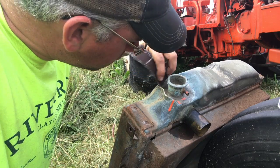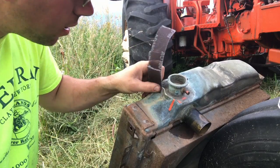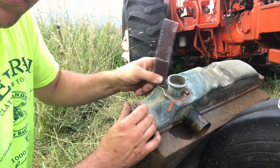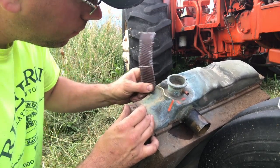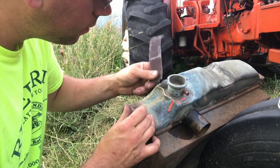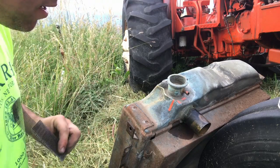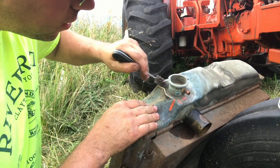Being really thin brass, I can solder this, which is nice, but soldering brass this thin can lead to its own challenges and can be a real nightmare because you can overheat this brass really quick. What will happen is that solder, instead of capping where you want it to cap, will actually run down inside the radiator and you'll still have your gaps left.